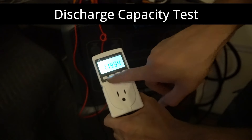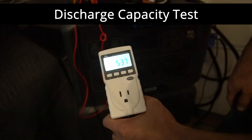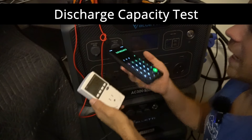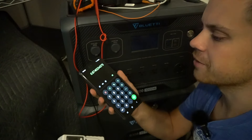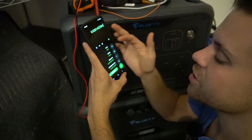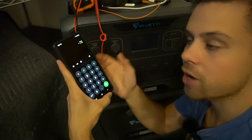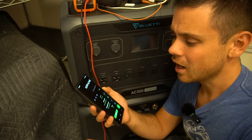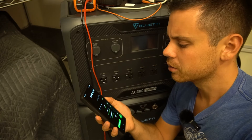The test is finally done. This model has a memory so it stored the result — 5.37 kilowatt hours — which works out to 87 percent of rated capacity. Maybe the other YouTubers were talking about round-trip efficiency, because 87 percent discharge efficiency is actually a very typical figure. The charge efficiency was 86 percent and the discharge efficiency was 87 percent. So I got the same overall figure they reported, but they were measuring round-trip efficiency. 87 percent for a discharge test is actually really good — a lot of other solar generators do much worse — so I don't see cause for concern here.